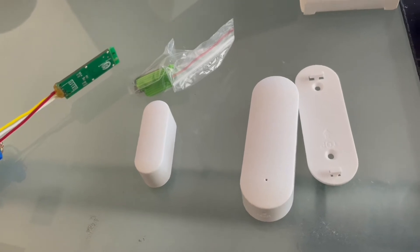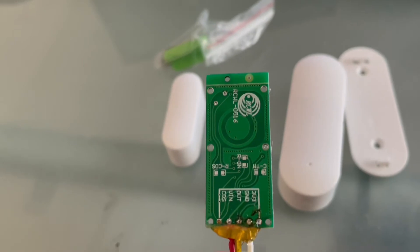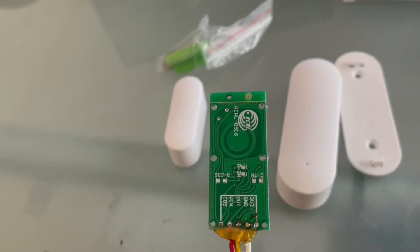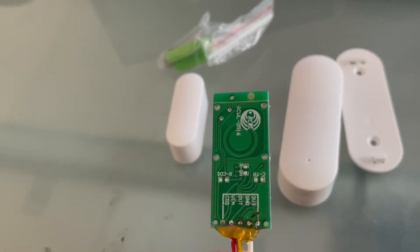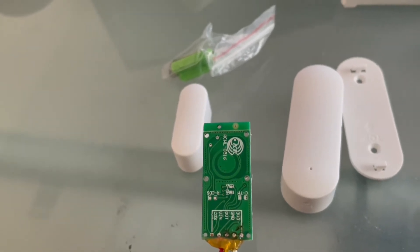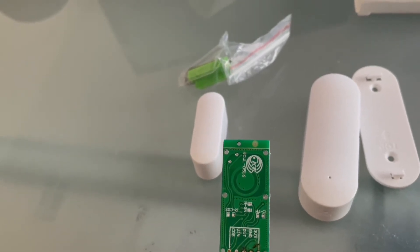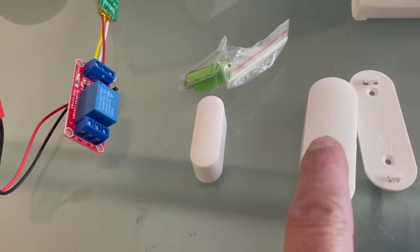You can write a routine so the Echo picks up the signal. The issue with this sensor is that while a person is moving, it continuously sends a signal, but you only get the message once. I want continuous messages while someone is present. For that reason I use the ESP32. The signal from the microwave sensor goes to the ESP32, which has a timer that activates every three seconds on and off, triggering the reed switch and sending repeated alerts.